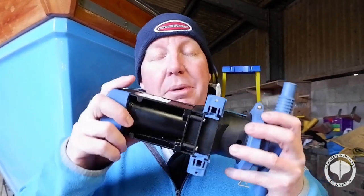So guys, now that we know where we're putting the pump and the strum box, and now we've got our angle as well, because you can actually turn the angle on these, which is absolutely fantastic. It's got a wee one-way valve in there, and it actually goes in any position. So you've got multiple ways you can actually put the strum box, which is exactly what I needed. Right, we now know where the positions they're going to go, so now what I've got to do is make base plates for them, get them glued into the boat, let the glue set. And it might take a while in this weather because it's still minus Baltic. The sun may be shining, but there's no heat. And we're going to make a plastic base for this to raise this up just that little bit, enough to get a couple of hoses in. So let's get on with it.